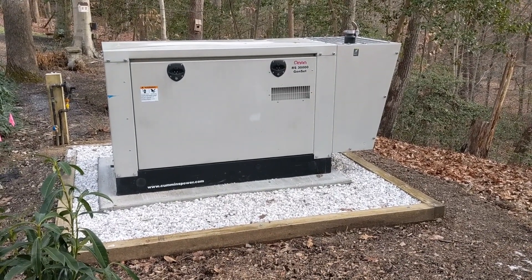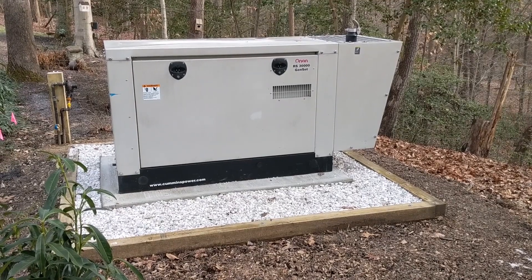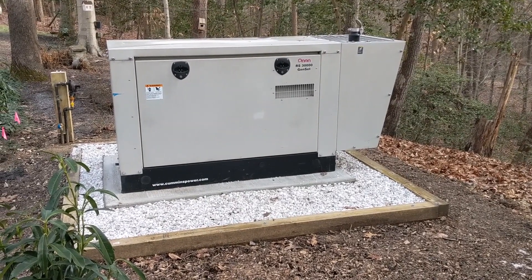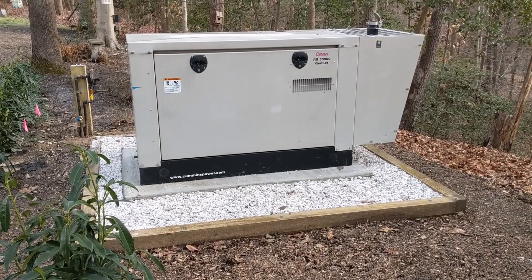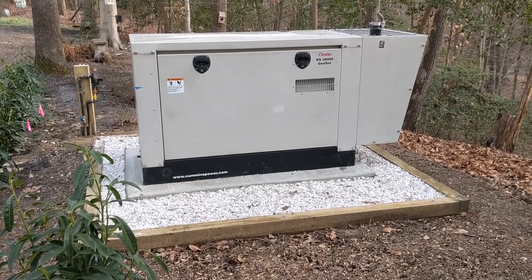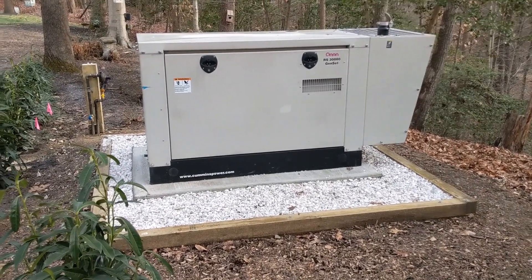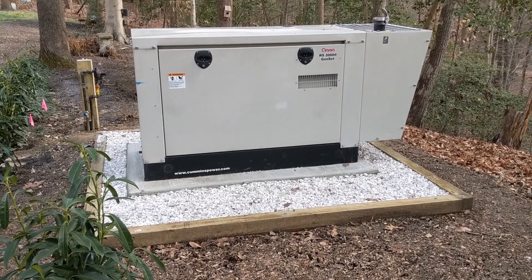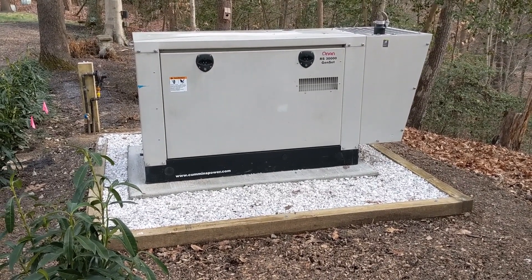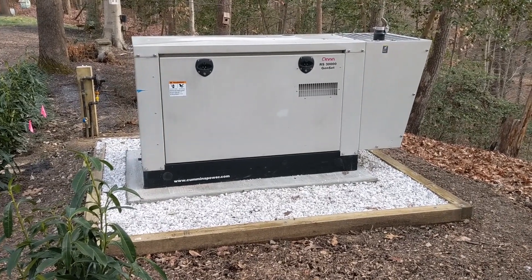Looking at the base here, we have a 16-inch concrete pad, three foot by about six foot, that goes down more than 16 inches with gravel underneath it. We poured 64 80-pound bags of concrete inside of it, and then we surrounded it with some 4x4s and stone just to make it look nicer, help the drainage, and have a little area to stand. And that's about the whole story on this.